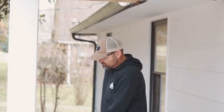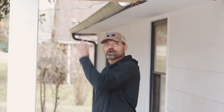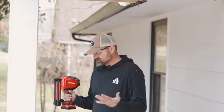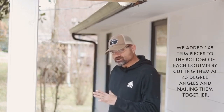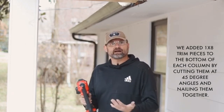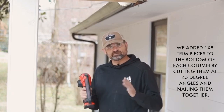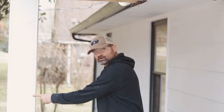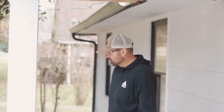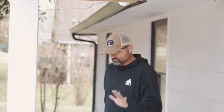The basic box of the column is built. I'm now going to move on to the base and crown. I'm going to use a 1x8 for the base because we want something bigger and chunkier to go with the more substantial column. I'll show you how I do that — you can do a butt joint or a 45-degree miter. We're going to use the 45s for a better look. Any seams will be filled with a light caulk, and nail holes too, but we'll do that later.